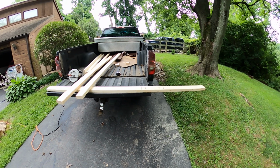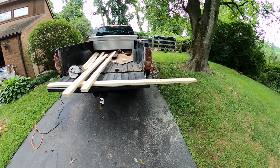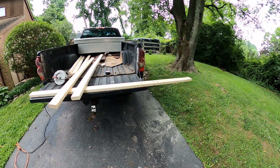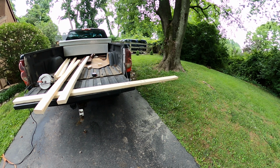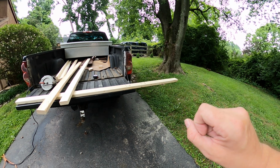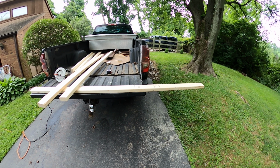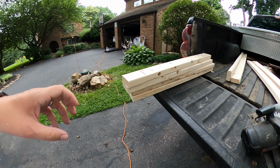Okay, as I measured, I did some more testing, and while I think 30 inches is okay, I have the ability to go 36 inches. So I'm going to go ahead and go 36 inches. It'll put it a little bit higher on the back, but I'm going to do 36-inch legs because I wanted to take into account, if I did 30 inches, the weight is going to push that carpet and carpet padding down a little bit. So it's not going to truly be 36 inches, but then there's half an inch of plywood. If I do 36 and it pushes the carpet down an inch, that's 35, but the plywood is half an inch, that puts me close to 36. And I think 36 is a fair height and will give me a little bit more space underneath, which will work out well.